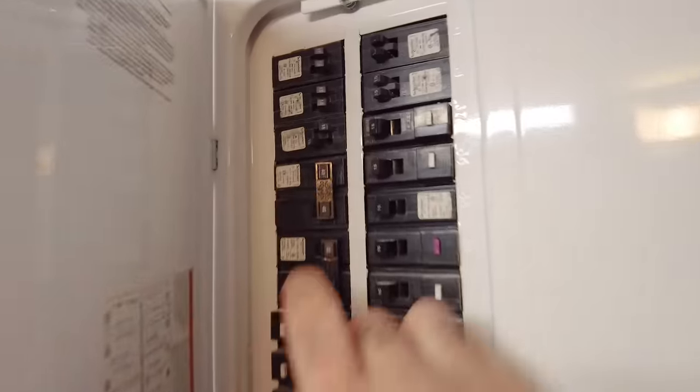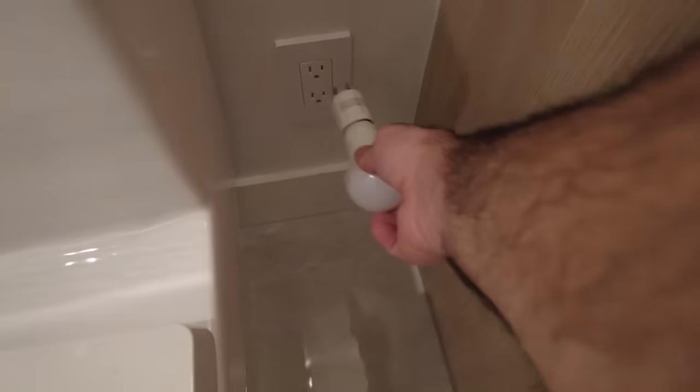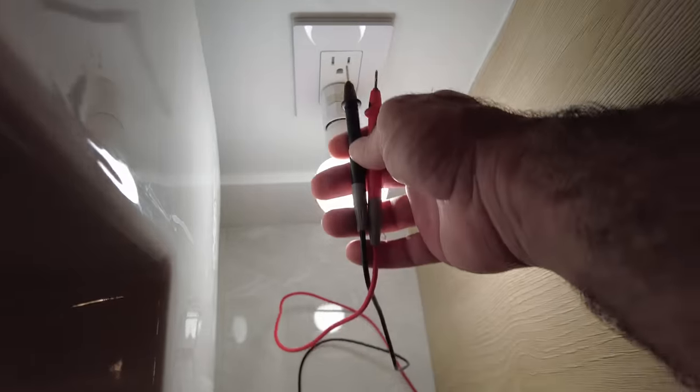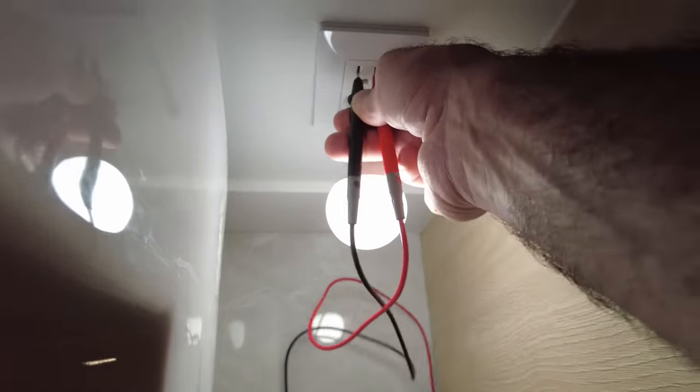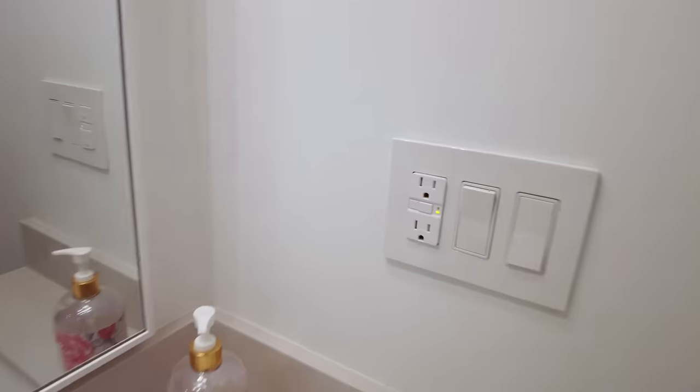Now we will test it. We carefully turn the breaker back on — no yelling or screaming. Let's plug this in and see if we have power. There we go! And again to test the GFCI, we plug these things in and place our 10k resistor between live and earth. It turned off — the GFCI is popped! Another perfect project down the drain. Now for the toilet seat, I guess we'll wait and see if somebody will sponsor me, but I have the means for a warm butt. I'm sure a ton of you are proper electricians who can leave a comment and let me know how I did things wrong. If you don't know what you're doing, these things can be pretty dangerous — always give it to a professional. I'm what you call a professional dumbass.